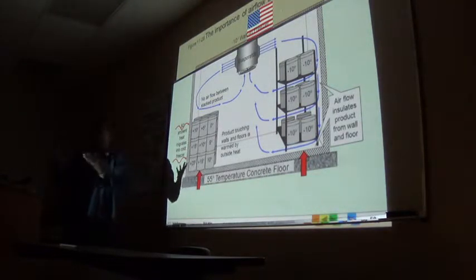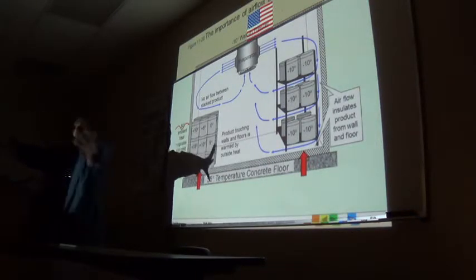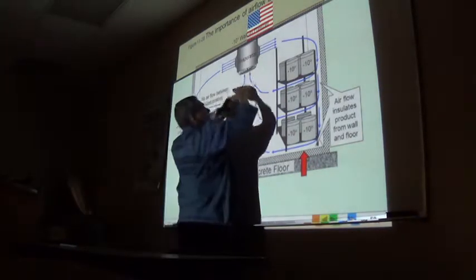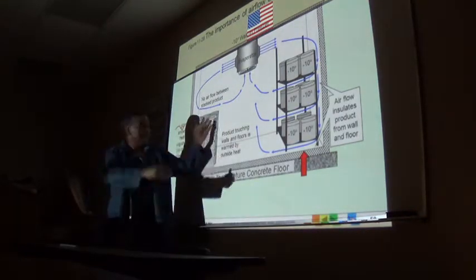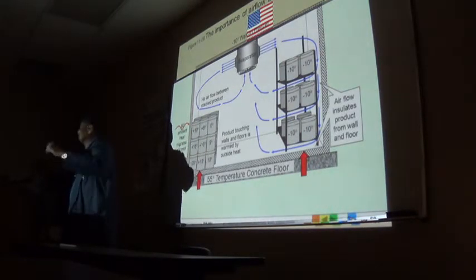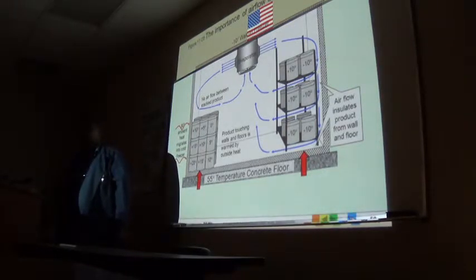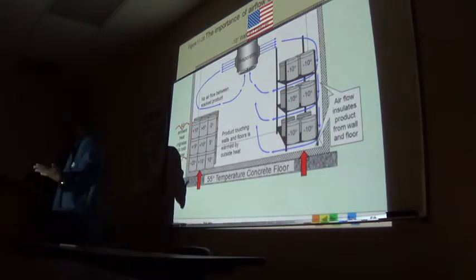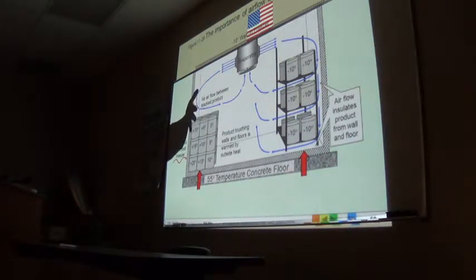Laziness, you know. What some of them do, they leave all that space there, and they pack everything under this, right up to here. Now, everything here is open space. But they call you to fix this thing, and there's no space for you to get access to that, because they pack all the food right under there. Guys, what's the sense? You leave all this space on the side here, and you're packing all your food there where there's like zero airflow.